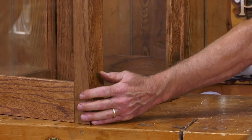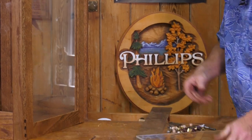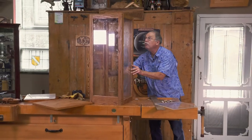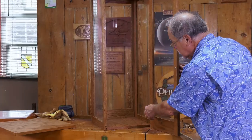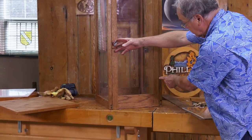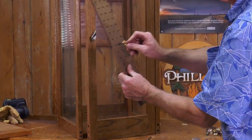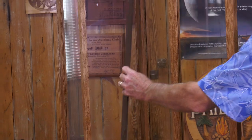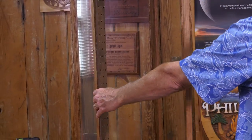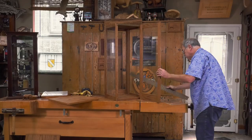So what we're going to do, I want to show you, perfect, do the shelves, which are polycarbonate, 3/8 inch, pricey stuff. You can cut that out on the bandsaw, but let me close the door. Show you a couple other things here on this cabinet, and that is zero mortise hinges that just go into that 1/8 inch gap. And then to drill the shelf support holes, this is 1/4 inch hole pegboard, 1 inch spaced, cut to size, and I just located those holes, and wherever there's a dark line, I drew a corresponding hole for the shelf mounting bracket.